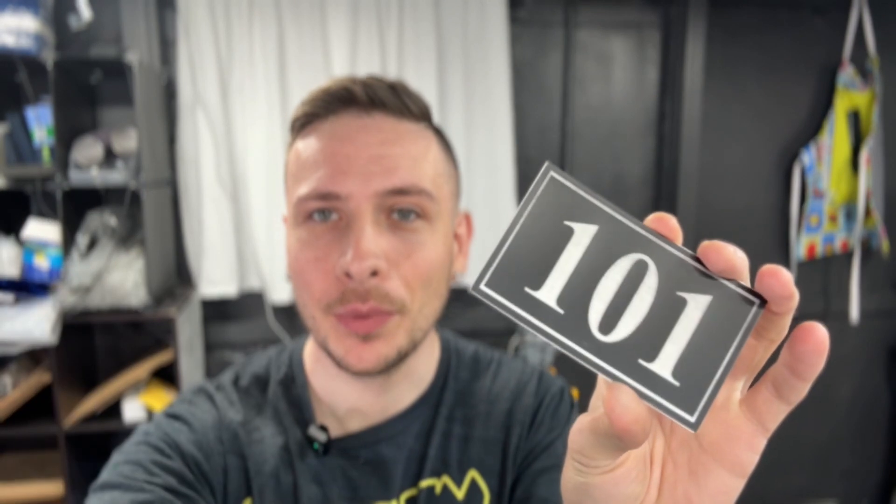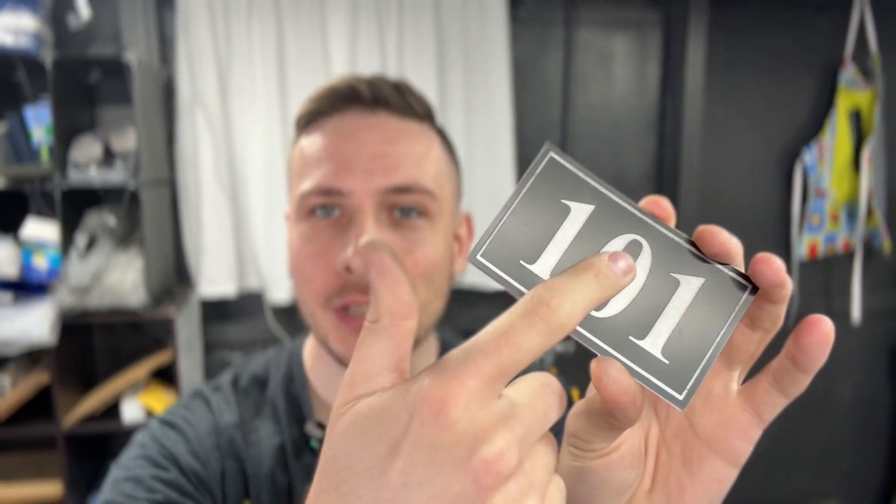With the original nozzle that came with my laser, I would take off the air hose and disconnect it while engraving, because you do not want air — if you use air, it might be a little bit harder to clean up. I originally used this two-layer acrylic to make these little number plates. This is one of the first ones I did — it didn't cut all the way through and see how it's really dirty there. That was with air on my original nozzle. After doing a lot of research, I found out you do not want air because what happens is the air blows the top coating and melts it back into the white, and that's how you get it all dirty.